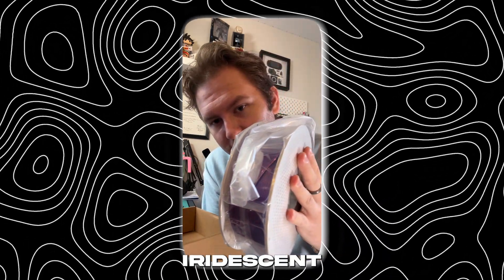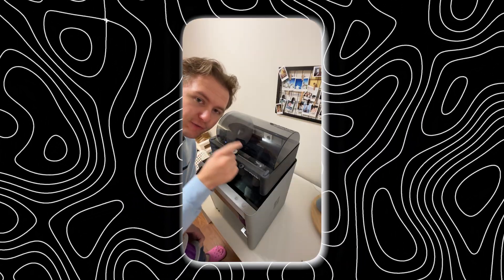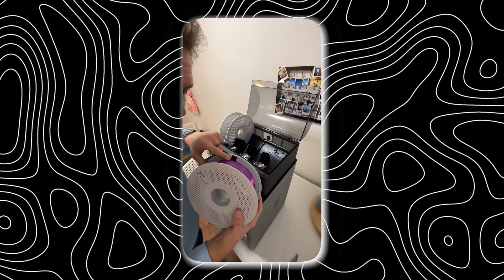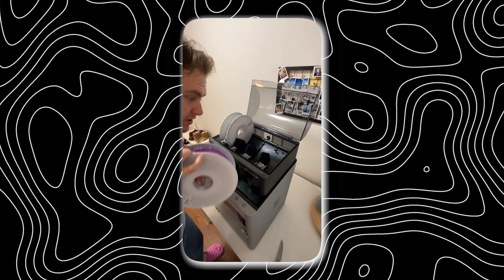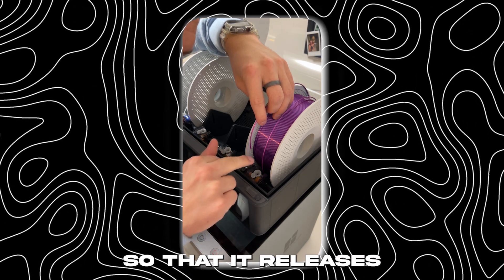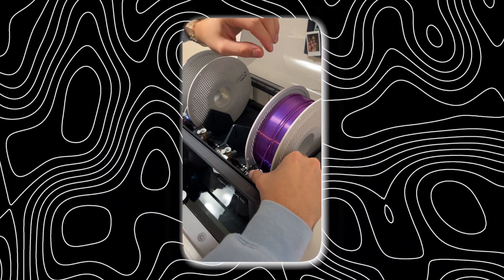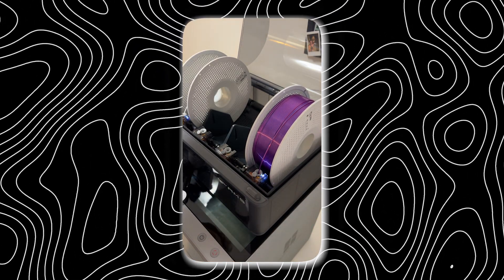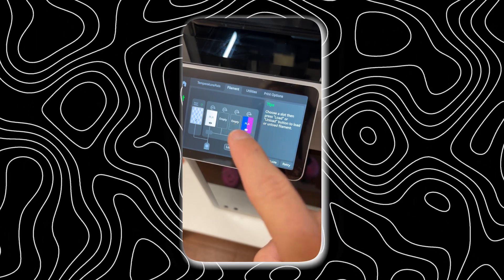But before we print, we're gonna load up a filament that I know she's gonna like. Some beautiful iridescent pink and purple silk PLA. Look how pretty that is — that is gonna be so frickin' cool. So first, let's open this up. We just need to unravel the spool and cut a sharp edge to get the tape off. Now we're just gonna load it in — push this little tab inwards so it releases the trigger, then push it down in so it feeds, and it will automatically start pulling. And now the printer notices the PLA, the color code and everything — so we're good to go.